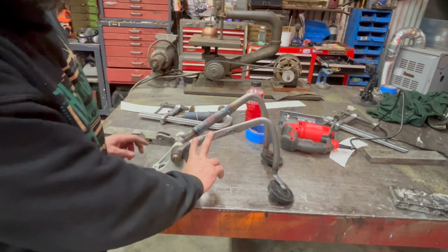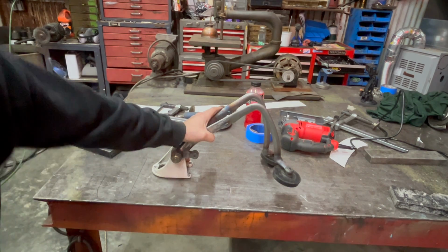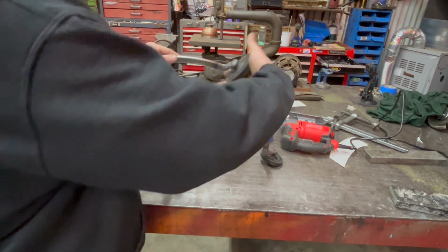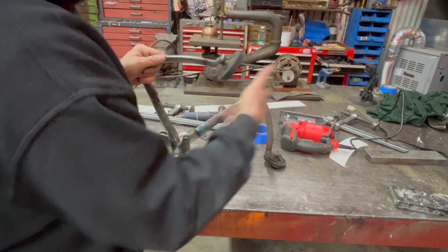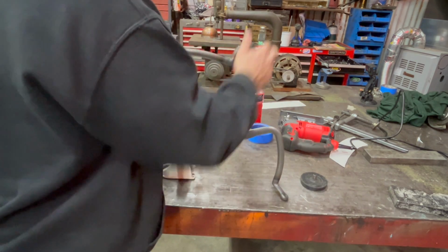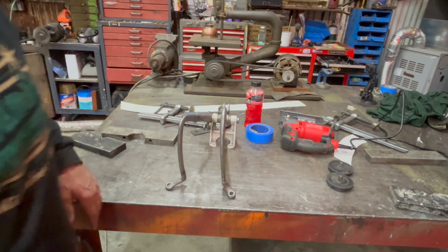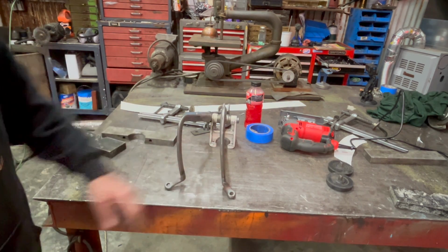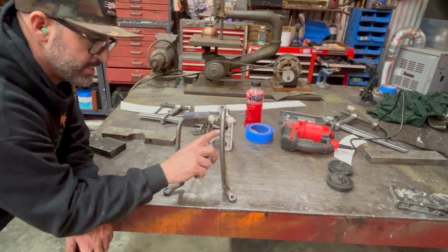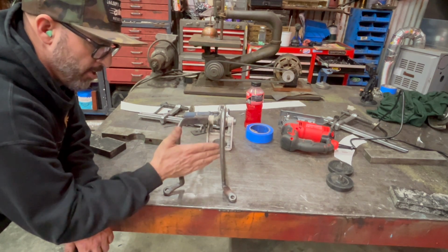All right, so you can see here clearly the difference in height. I only took material out of these here. I took 1 inch out. Basically, if you keep it up level, you'll see this is the distance here. I'll pop these pedal pads off. So basically what I need to do is take 2 inches out of this one here. Trying to figure out where I want to do it, because if I take a section out here, when this arm falls, it's going to fall inside.